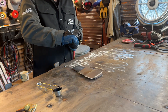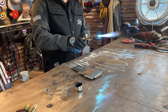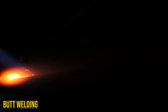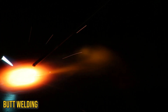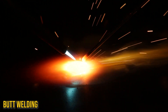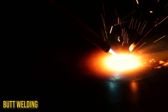Now let's talk about welding two pieces of metal together. I went ahead and got these pieces of 18-gauge carbon steel sheet metal prepped to run a basic butt weld. First, I'll need to tack the two sides, then get our puddle started. When we see it drop, we're off to the races. Moving forward and adding filler, we want to make sure we're seeing both pieces of metal melting. What you want to look for is something called a keyhole, right in front of your puddle, which is where you can see both pieces of metal melting away — that ensures you're getting fusion to the root of the two pieces.